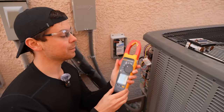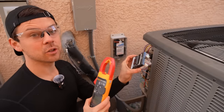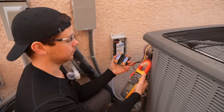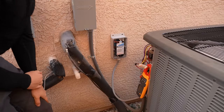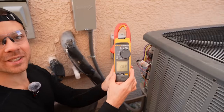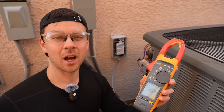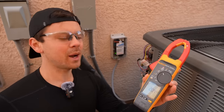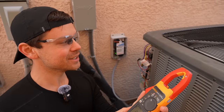I'm going to connect power without the cover on because I want to measure the inrush current, but I do not recommend beginners doing this — do not put power back in until you have the cover back on. I have an inrush clamp meter and I'm putting it around the brown wire. After adding power and turning on the air conditioner inside — look at that, 20 amps — usually it's 25. After startup, you have to turn it on and off about five times so the device can learn what your air conditioner needs. It will have a four-step ramp-up process and will optimize for your air conditioner over time.